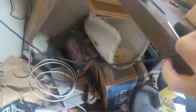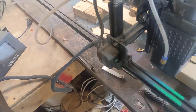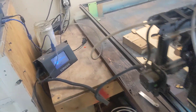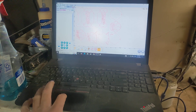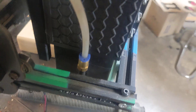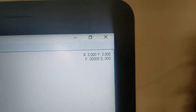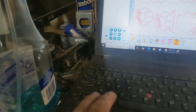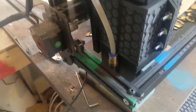We'll grab our limit switch wiring, carefully plug it back in, and then we're going to move our laser head away and let it all fire back up. Come back up here, reconnect, hit our home button, and then if you look in here, this is something you need to keep in mind: it always rebounds three by three millimeters. Our X is at three, Y is at three. And you can actually, if you're wanting to start from true zero, manually adjust it to true zero.